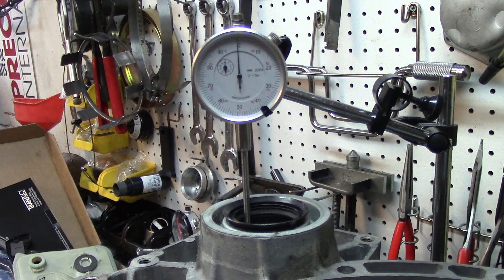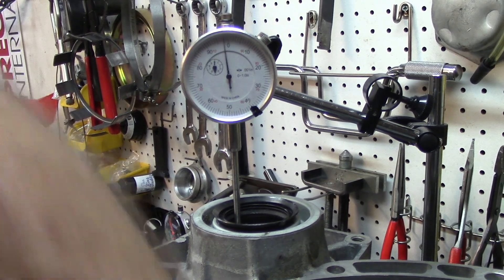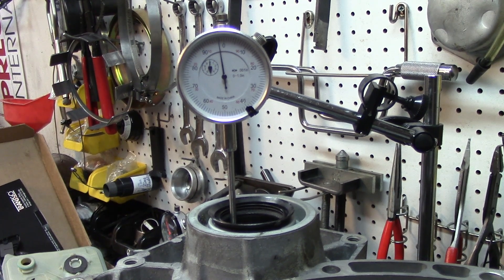I can get my hand in here — it turns with my hand, which is good. It's not tight and it keeps on turning. So there we go — that's how you shim a case, and that's how you use an H gauge. I hope you enjoy this short clip. The trial and error in trying to set you guys up for a good shot is not really the ideal way to do this — I could have just filled the transmission up with parts. This is a complete overhaul on a 6F35, 2014 and up. I think this is a 2019 model.